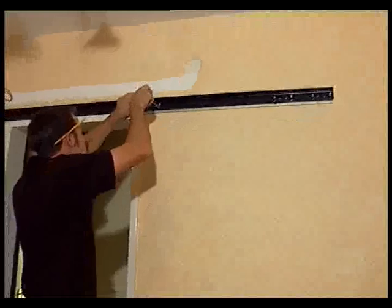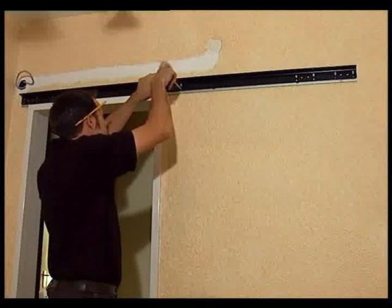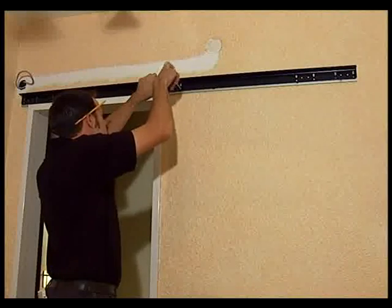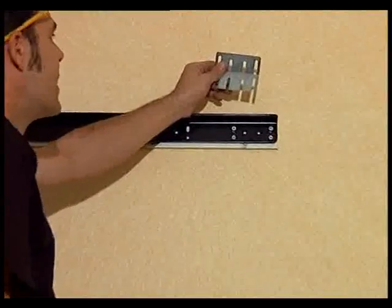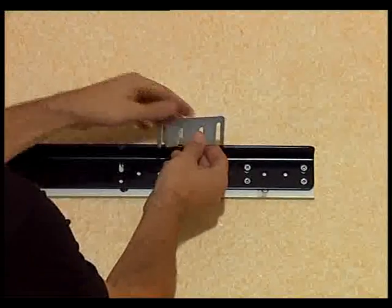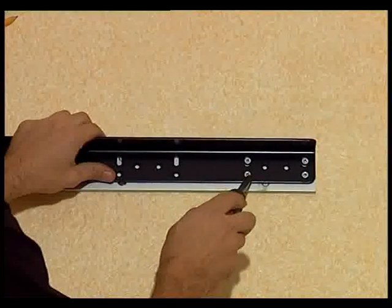The shim plate is equipped with metric internal threads that match the fixing holes of the mounting bracket. In case the shim plate is not mounted flush with the door frame, we have enclosed distance plates to compensate this discrepancy. Fix the mounting bracket to the shim plate with the aid of the enclosed screws.